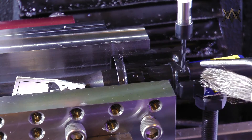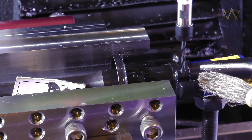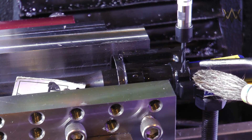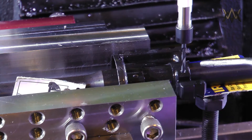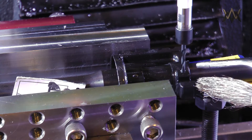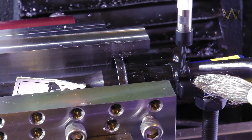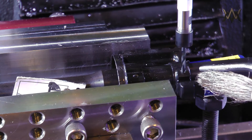When looking for a drill to use, make sure to use a coated carbide drill. I tried it with a cobalt drill and it just destroys the cutting edge — that nitrided surface is so hard. So definitely stick with a carbide drill, and preferably a coated carbide drill.